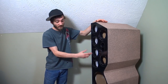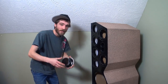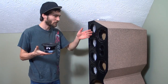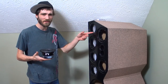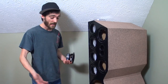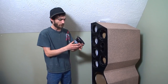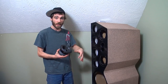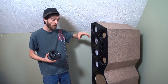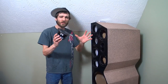Today I am going to be putting in the last six of these speakers, the Designer Series 5s. I got them sitting right here, and boy oh boy, what a night and day difference from our previous drivers. We had some mismatched ones on these sides, a little bit bigger than these ones. There were some idiosyncrasies, but I really loved the way everything sounded. These are roughly about 6 ohms a piece, so we wired each pair up to about 12 ohms — and then 12 divided by 3, the three different chambers, is a perfect 4 ohms. So these things couldn't have worked out any better.